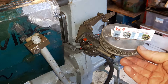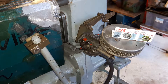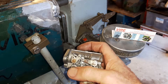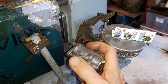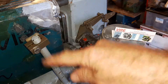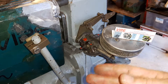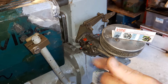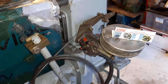So your options are: when you order a carburettor from me, you either have the old style adjustable lever or the new style non-adjustable lever. Because the choke is only used when the engine is cold, and then only for about 5 or 10 seconds, is it really worth putting a cable in? If you have easy access to your engine, I would suggest that the manual choke is easier and it's the modern way to go. You probably have to open up your engine compartment anyway to turn the seacock off and prime the fuel with the squeezy bulb — so why not put the choke on until it's running as well. I don't really think these remote controls were such a brilliant idea.